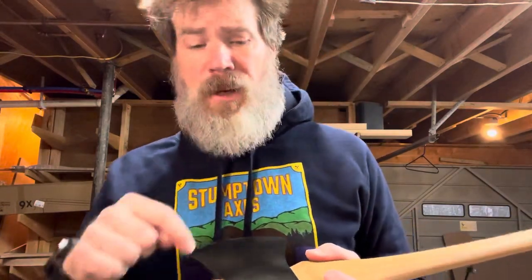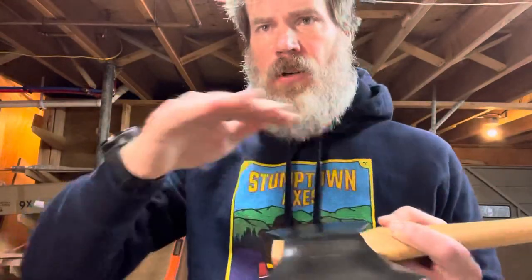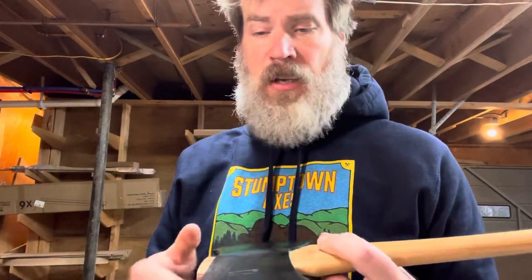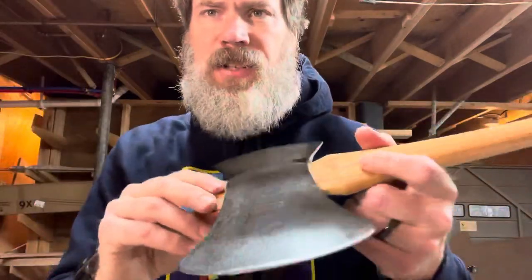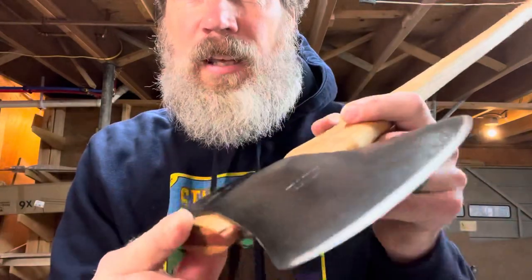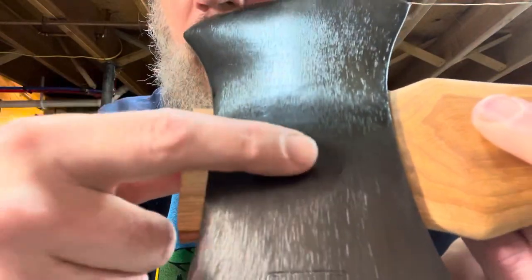I had the blue in and around, but I've had mixed results. The times I've done okay was when I had treated the surface of the metal a little bit with sandpaper or Scotch-Brite pads before. So I said, let's just try it, see how it works. And it took right away. This is two coats — this is dark. I know it's tough with lighting to see, but this is pretty consistent, and it left that pattern underneath. So it has this great texture on there.